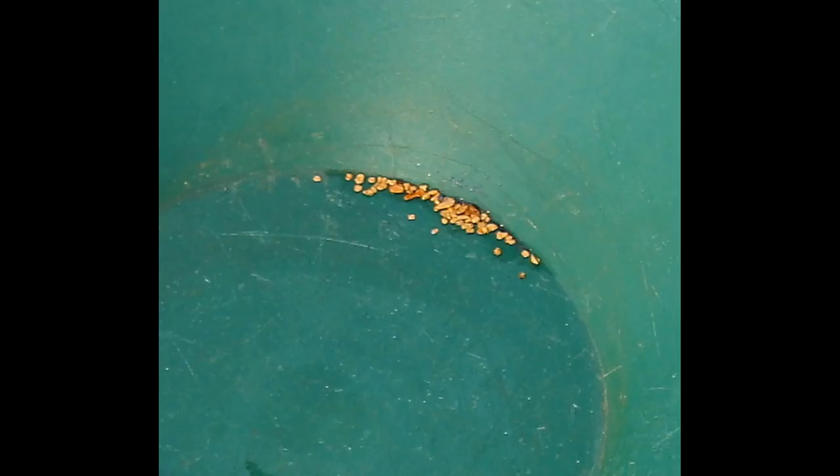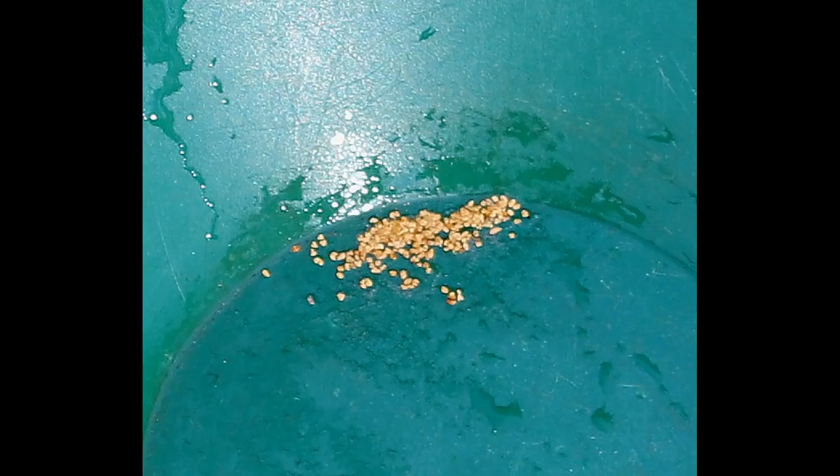This is much more weight than the little picker nugget I got out of the oversized 12, and this is a nice yield that will contribute to the weight we're getting. Here is the size that's smaller than 30 mesh but bigger than 50 mesh — again, little flakes and pieces. The next size fraction is going to be too small to easily pan — it's the minus-50-mesh — and that's what I'm going to use the blue bowl for.